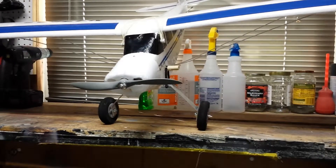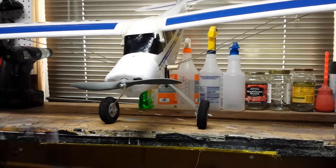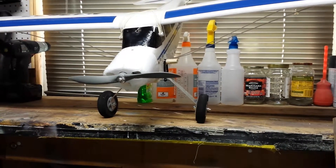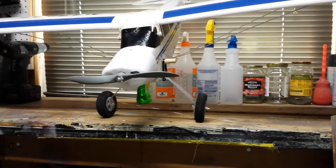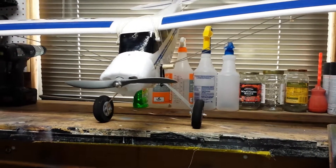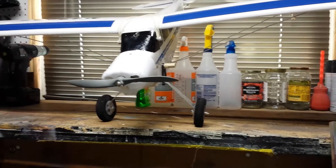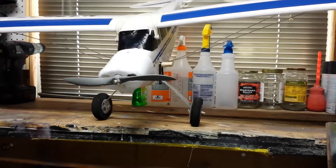For the motor, I went to Hobby King and got a Turnigy outrunner — it's a 1050 KV, 18-amp motor. I backed that with a 25-amp Plush Turnigy ESC with built-in BEC, and we're running it on the stock 1300 milliamp three-cell Park Zone battery. We're getting about nine minutes of flight time, and the motor and ESC run completely cool — never ever gets warm at all. It's turned out to be a pretty good setup.